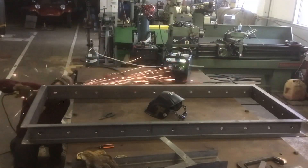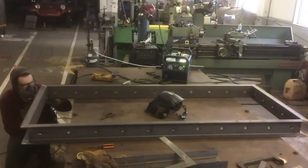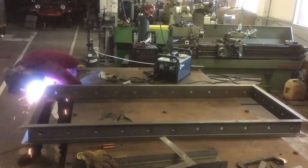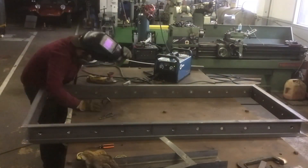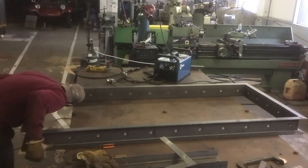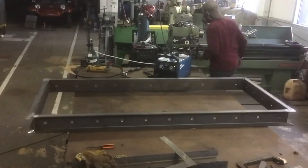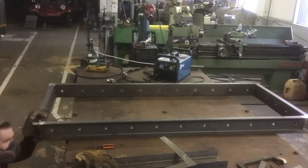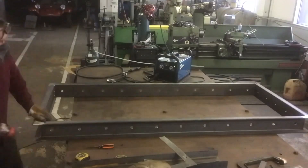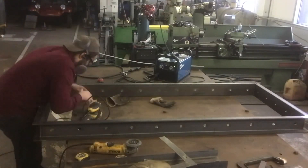The customer's only requirement was that it was within an eighth of an inch of wobble across the eight-foot span, and we were able to do that with no issues at all. The frame, even though it's 3/8-inch thick, actually has a little bit of flex because the legs are so heavy. Even when I took it off the dead-flat welding table and put it on the ground in areas that aren't perfect, it was able to sit really solid and rigid.